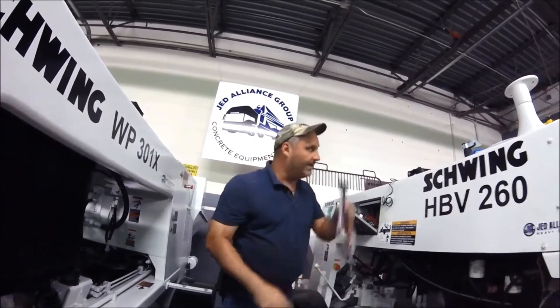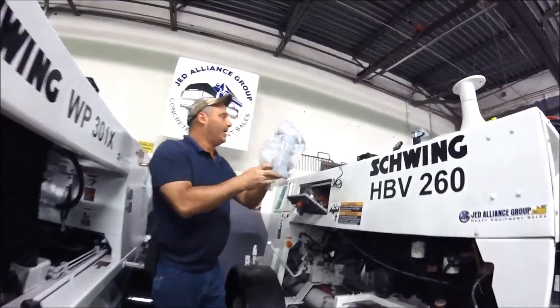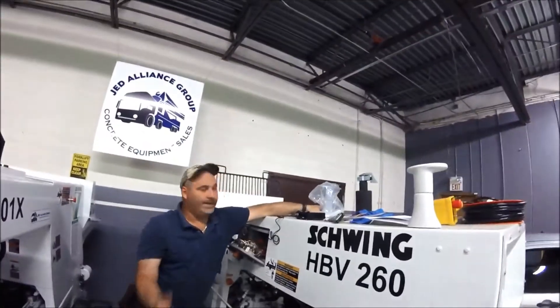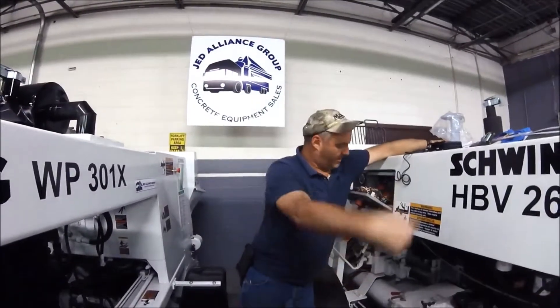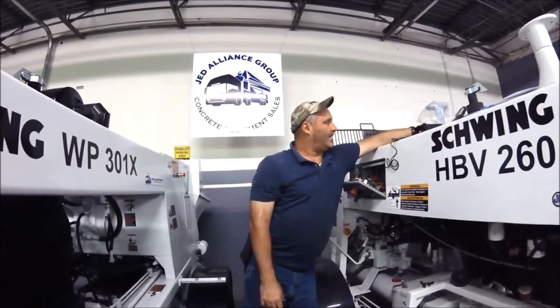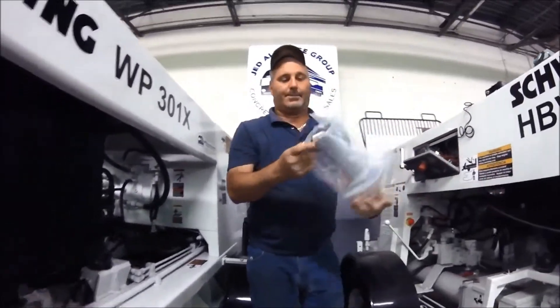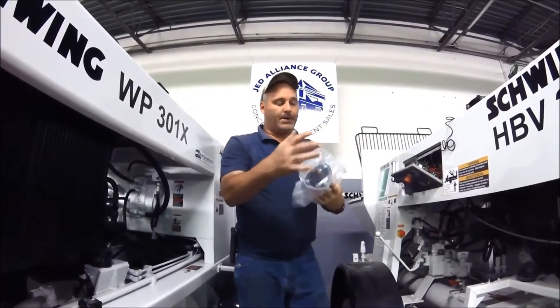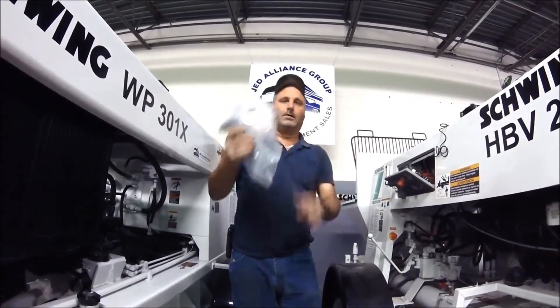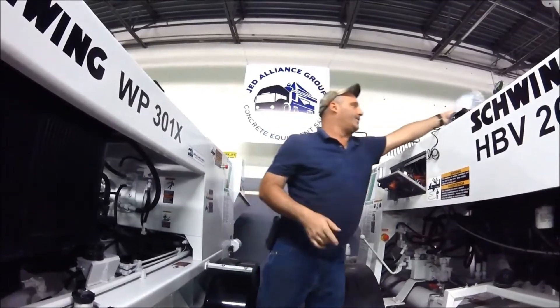I route the antenna the same direction. I put it in a good area, usually right behind the muffler, so you don't have any wind hitting it, and then I throw it right to the receiver. It comes with a little template in the book — pretty nice option. Copy from the book, put a piece of tape on the machine, drill the holes, it sits right on there, run the hardware off. Pretty easy.